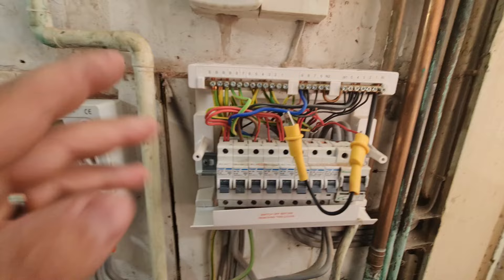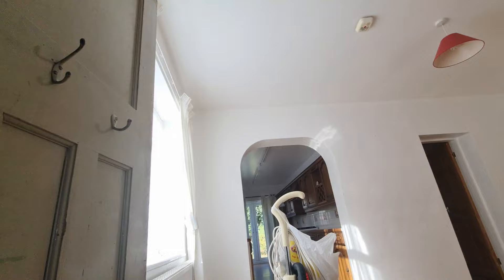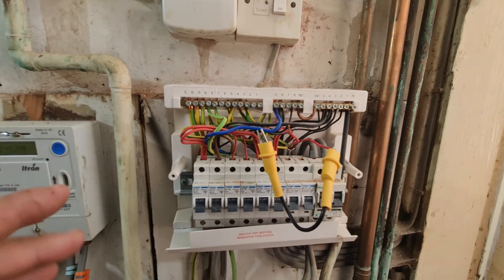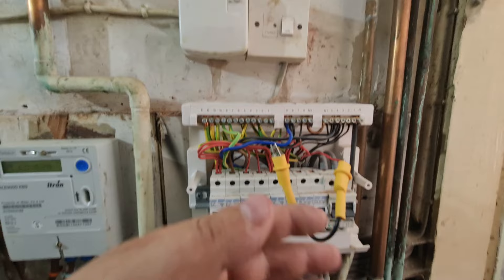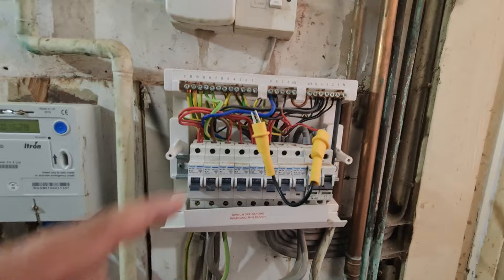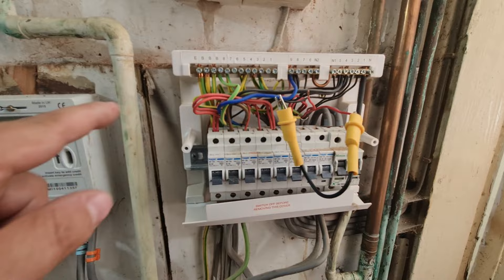It's so easily done where somebody may put a line with a CPC in a circuit accessory and forget about it or make a mistake somewhere in here. And whilst when you turn everything back on at the end it should go with a flash and bang, it's not always the case and you can leave a fault in the system. So I always try and disconnect things, connect them together outside of any of the equipment - so I know when I'm re-terminating, there's a better chance of getting it right. We can run around the lighting circuit now, get our R1/R2 using the TIS Lightmate set with the MFT Pro Plus.